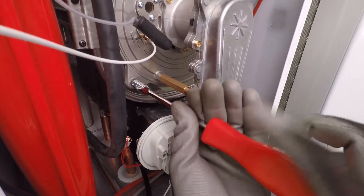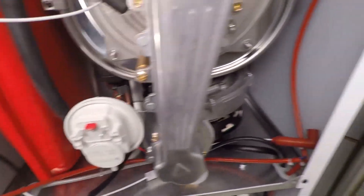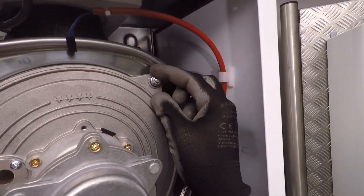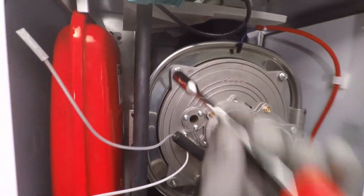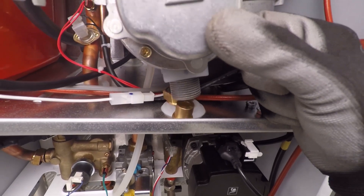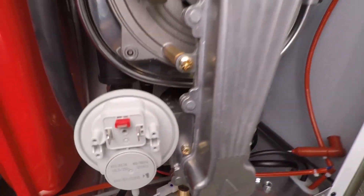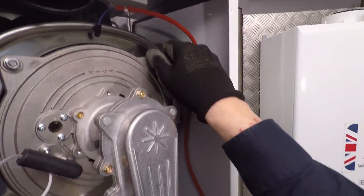For those of you that use a torque wrench, when doing these bolts up anything between 6 and 9 Newton metres is a good torque setting. For the top two, just unscrew them until they're at the end of the thread. Now if you watch, the injector will just fall out but it won't fall out of the boiler - leave them to the side so you don't forget to put them back in. Now I can take these two 10mm nuts off.